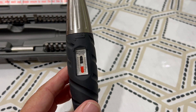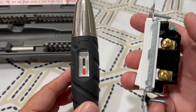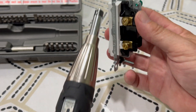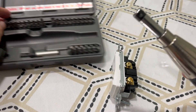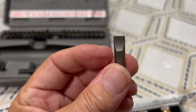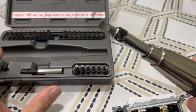So if I was to take a switch and I want to torque these terminations — once we put some wire in there — we need to put a tip on the end of the torque screwdriver. Typically I like to use these flat heads, this big flat head here. It seems to get me the most bite. That just sticks in there — boom.